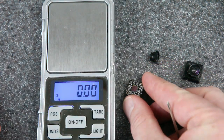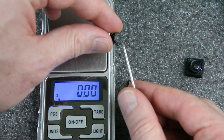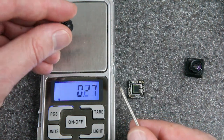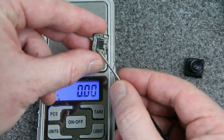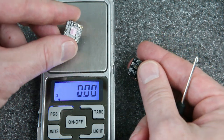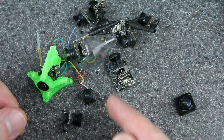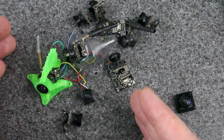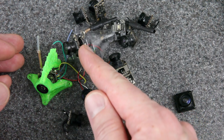This is the sensor board from a Runcam Nano 3, and this is the original Runcam Nano 3 lens. I'm not really a big fan of the current Nano 3 lens because it has a narrower FOV, but this first lens was pretty good. Check out how light this lens is — a quarter of a gram. Now to fit a lens like this on the PCB, you have to have a clearing right around the sensor where there's no other electronics. The Runcam Nano HD isn't like that — this one has to mount all the way on the outside. If you basically take your favorite old whoop camera with one of these types of lenses where you know you like the FOV, it would probably work on a build like this. What analog whoop camera would you most like to see converted into something like this? Comment down below.